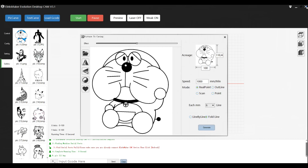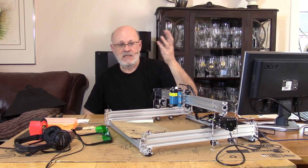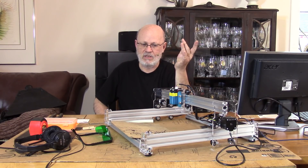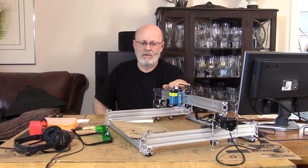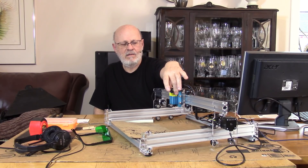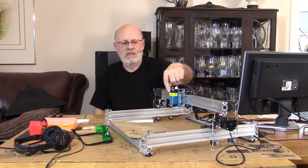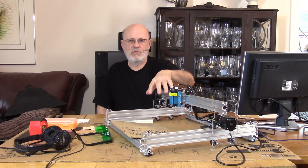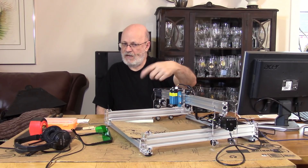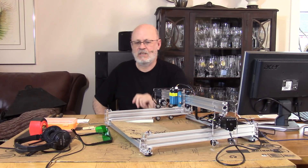The possibilities of a 2.5-watt laser: this is an LED laser. It's not meant to burn metal, stone, glass, ceramics, or those kinds of materials — it's not the right type of laser for metal and it's not powerful enough. On this unit you can install more powerful laser modules. This one is 2.5 watts and I know there are options up to 15 watts. For small jobs 2.5 watts is pretty good. At 15 watts you'll need to move faster, but it gives you seven times the power — that's starting to be meaningful.